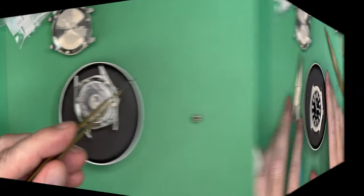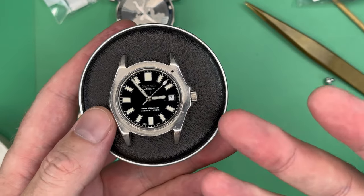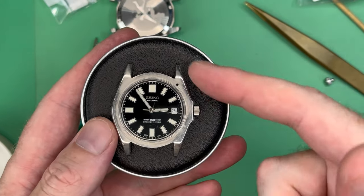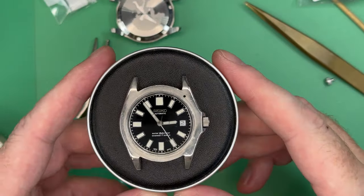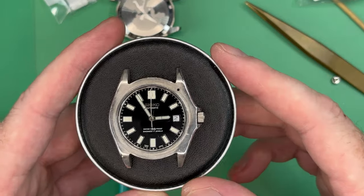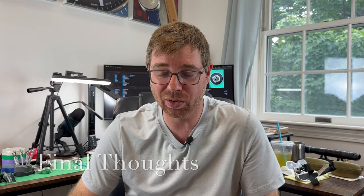I've put the loctite on the stem and crown connection, screwed it in, letting it dry, and set the time. We'll just judge over the next day to make sure timekeeping is working okay. The customer has a bezel they're going to put on, so I didn't have to worry about that aspect. We're all sealed up and ready to go — look at this beautiful thing ticking away. The crystal could use a replacement too, but that wasn't part of this project. Another combination I can add to my list on watchcomplications.com — the flexible use of the Ronda 515, a great fifteen-dollar quartz movement, going into the old Seiko 023.